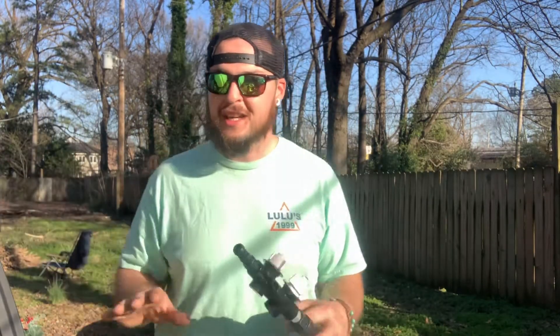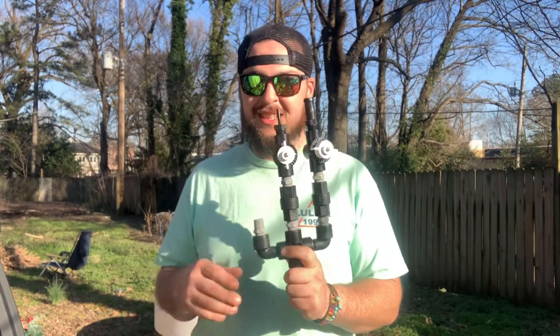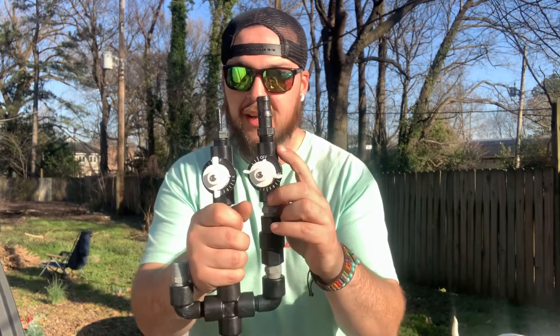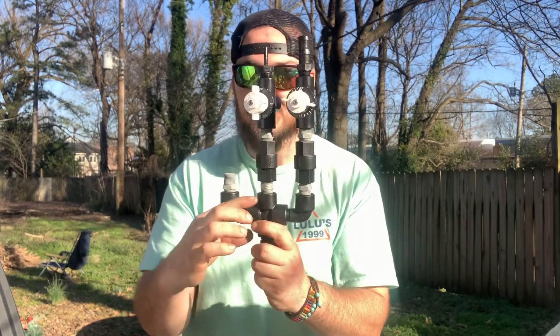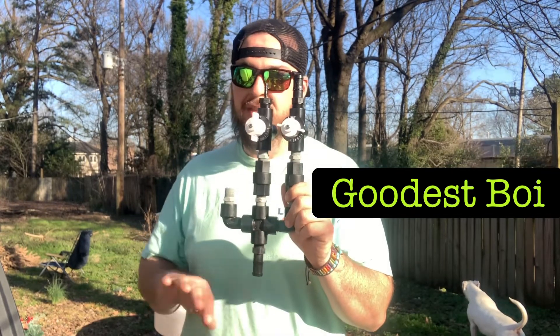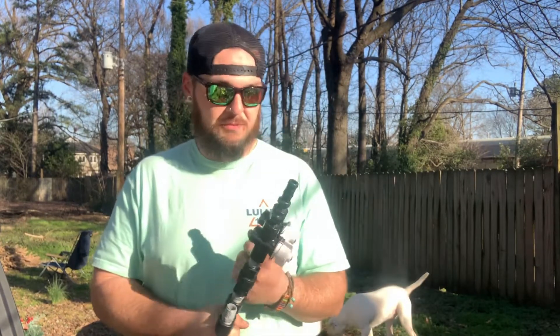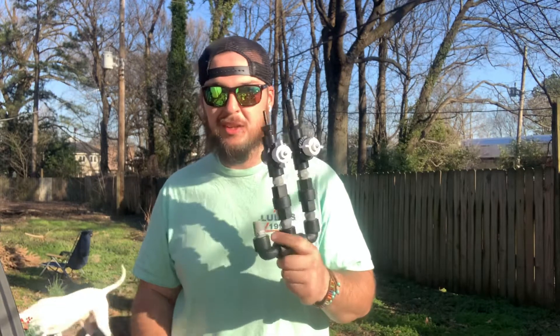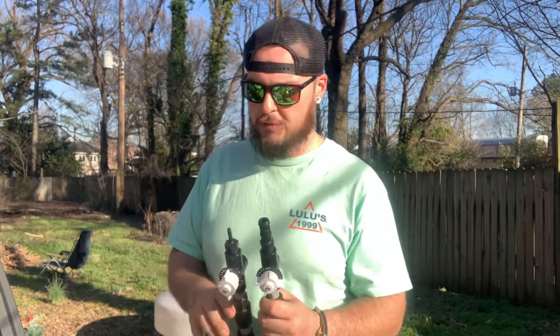It don't cost you a penny. Today we're doing work on our trailer. We're trying to get our tank system up. I'll show you how we're building this. This is a mixing valve, or a blending valve, or a proportioner, or whatever you want to call it. It has chlorine meters right here. Goes down into a manifold — basically a four-way manifold. Blends all your chemicals going in right here, comes out, goes to the pump, pump shoots it out. There's a thousand videos on Facebook and YouTube about how to make these. I'm going to go over the basics of what I've learned. This is the first one I've made, so I'm doing something a little bit different — something I've heard from guys that actually build skids and trailers.